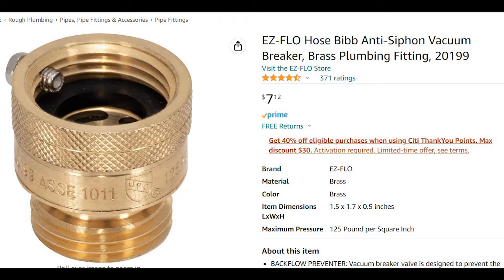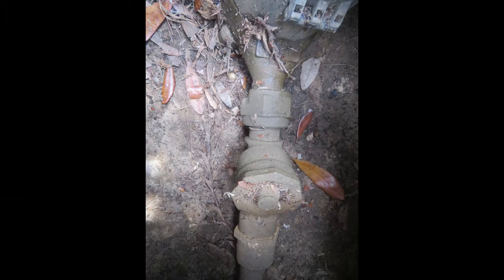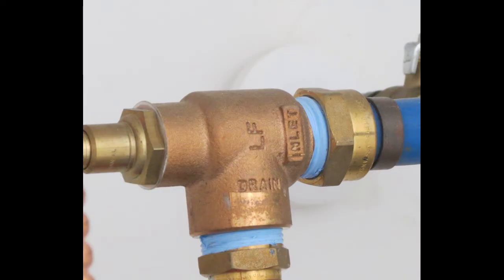When I went to plumbing school I spent almost a whole day on the proper application of backflow preventers. There's a set screw that's supposed to be broken off so you can't remove it. But it seems nutty to me — why don't they just put a check valve at the meter and be done with it? Now you're depending on the homeowner to put one of these back on when they replace their hose bibs. Most municipalities have caught on and now have a check valve at the street. That's why all that high pressure builds up on your plumbing system inside the home.